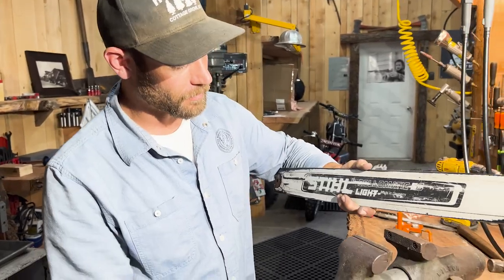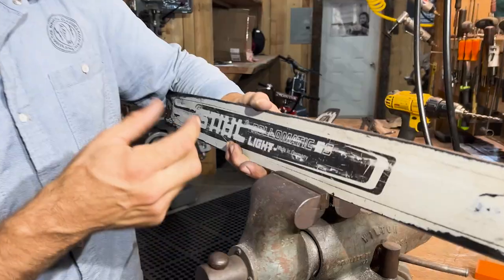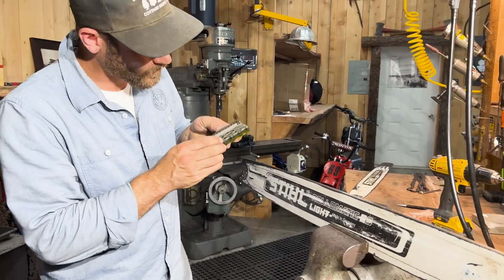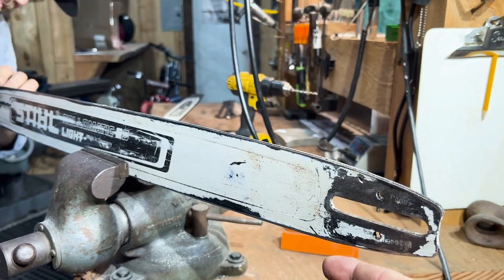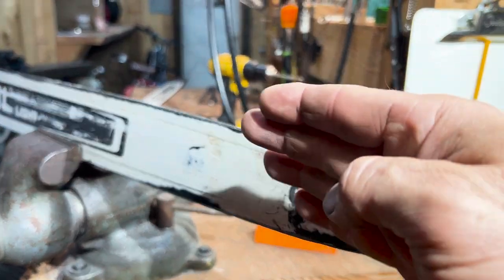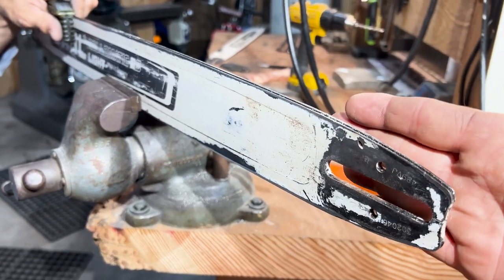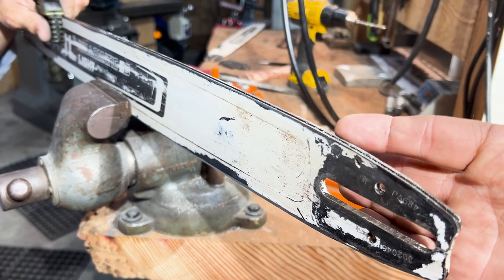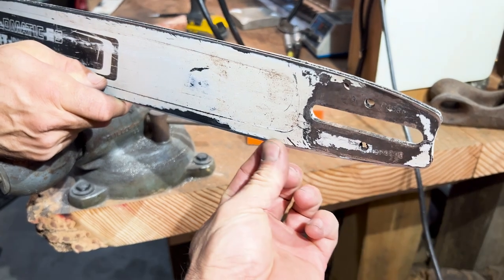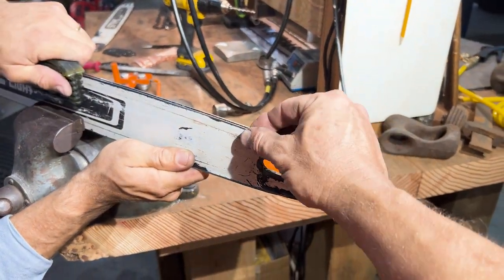Something learned the hard way: if you're going to pinch your bar in a vice lengthwise, pay attention to where your rails are — if you pinch it right on the edge of the rail too hard, it'll pinch your rails closed. Also, since making the West Coast Saw clutch covers, we've found that some Stihl Lightweights — even brand new out of the box — are concaved on both sides right at the outside edge of the rails. Take your flat file and run it across; you'll see it start peeling paint. That concavity can actually pinch the chain between the bar plate and the clutch cover.